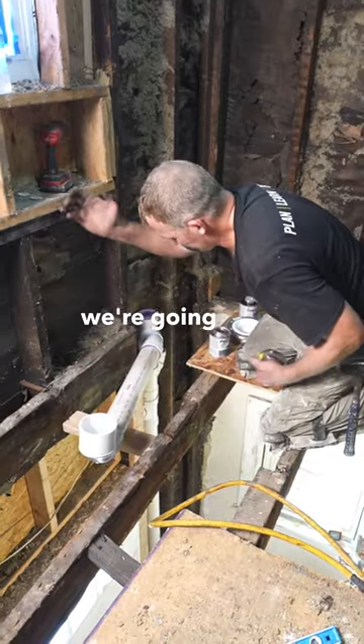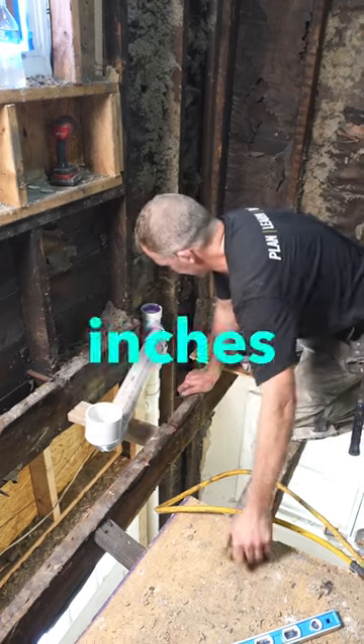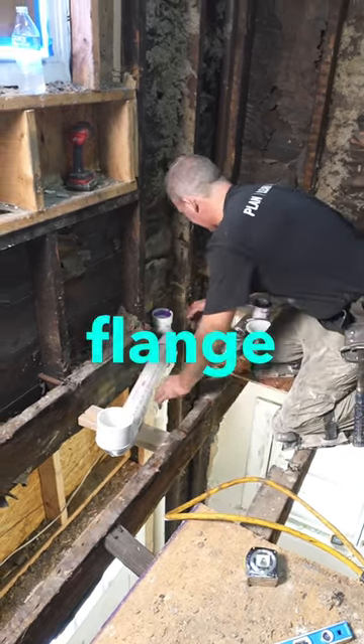But in this scenario, we're going to be putting tile as well, so I want to give myself a little bit of room. So we'll make this about 13 inches to the center of my flange here.